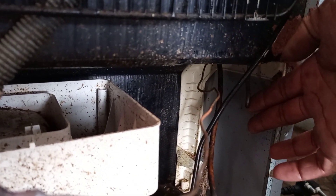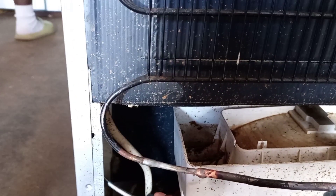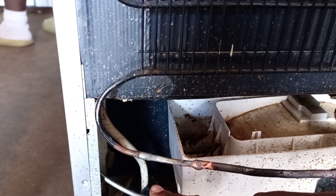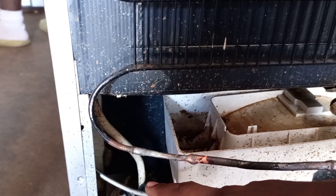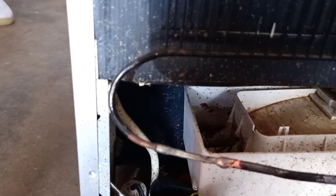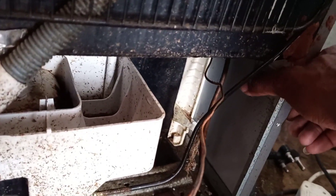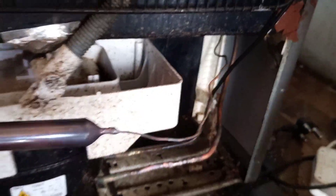After that I pulled a vacuum and waited 15 minutes to see if it went back to zero. After that I put gas in and waited 15 minutes to see if it was dropping. The vacuum did go back to zero after closing, and my gas was dropping — so I confirmed it was leaking.